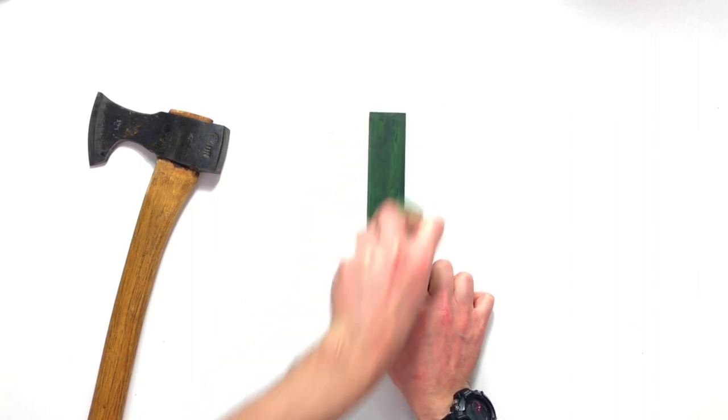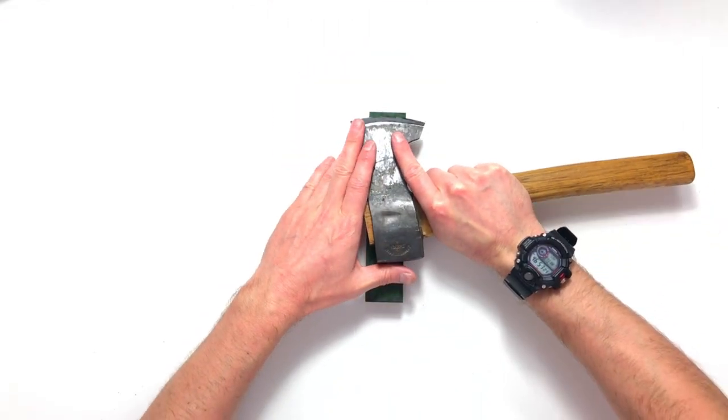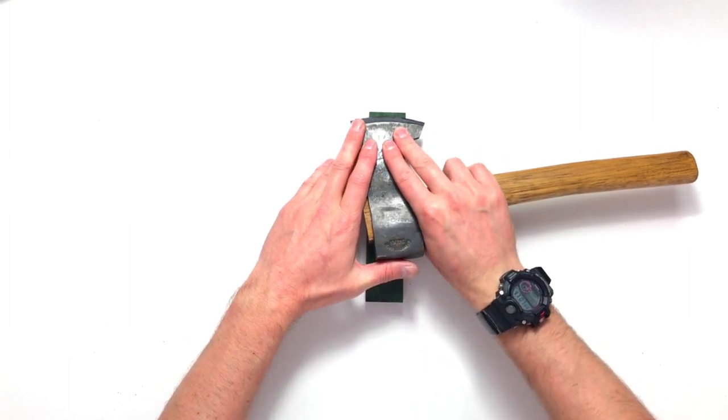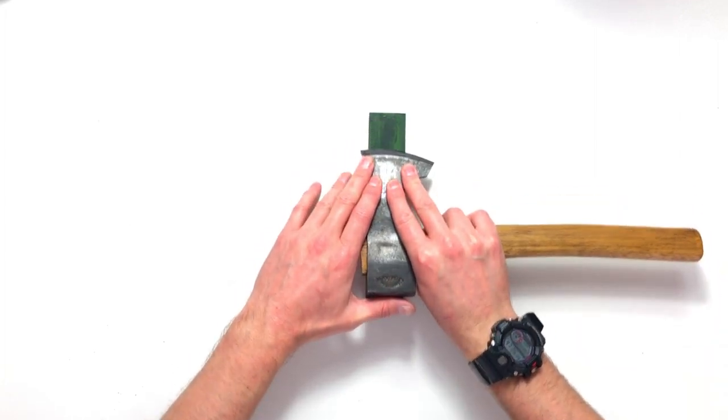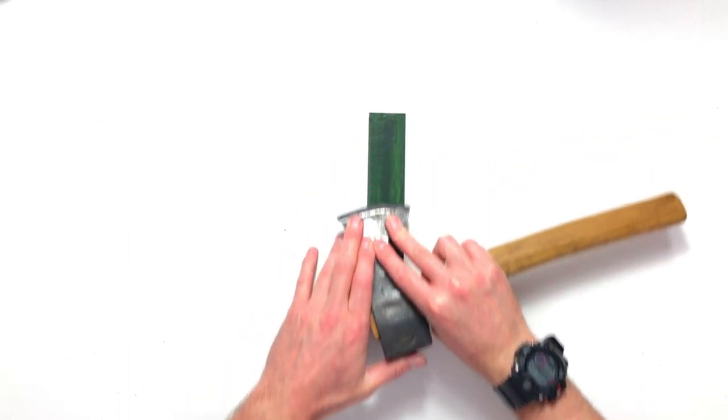What we need to do is apply compound to this block. My preferred compound is Veritas — it's entirely up to you really, but if you're using my sharpening system I highly recommend it because I know it works, it's very good quality compound, and I know it won't affect the strop. When you're stropping a convex bevel, make sure you're not doing circles on the strop — you only do circles on the abrasive paper. If you do circles on the strop you're going to damage it. We're working on the flat bevel: same position, rock up onto that cutting edge and then draw back, repeating the same fashion.